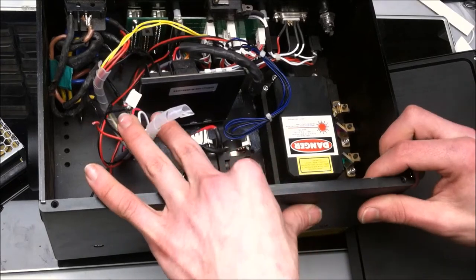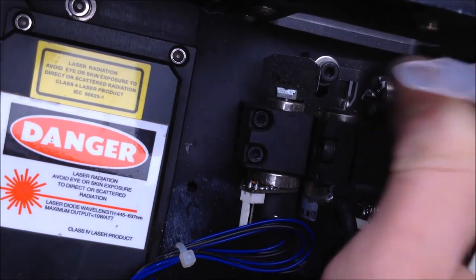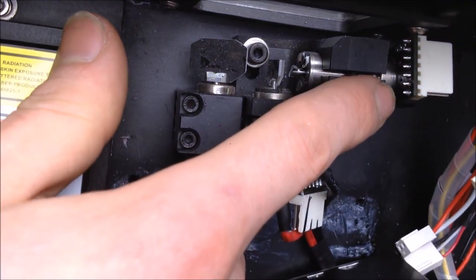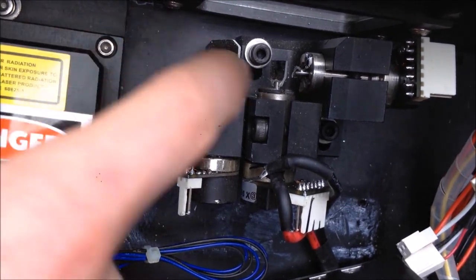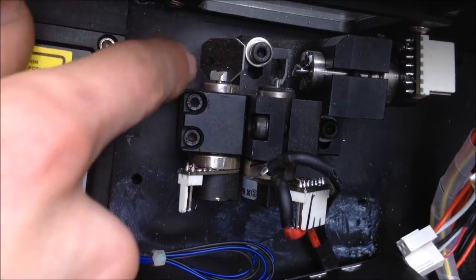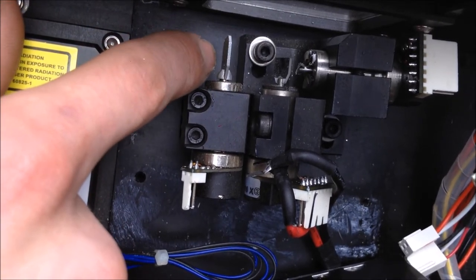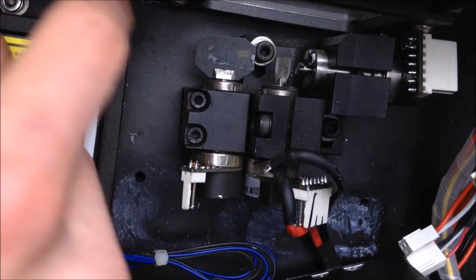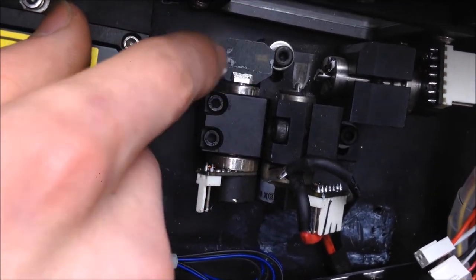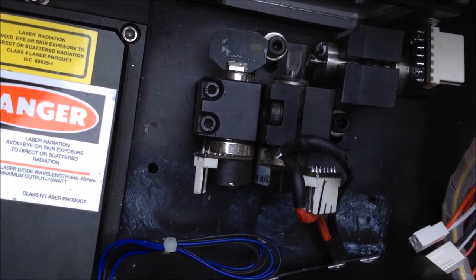It's just basically, yeah, the shutter here, let's see. Alright, move this out of the way. So, in addition to the X and Y Galvos here, there's also this piece, and these are shutters, mechanical shutters. They'll either be closed to block the beam from hitting the galvos and going out, and then when you have the laser enabled, the shutter will go sideways, and the beam will then be allowed to travel past the top of the shutter, the shutter window, and then out once reflected off the two galvos. So it looks like there's going to be a lot of things going on with this one.